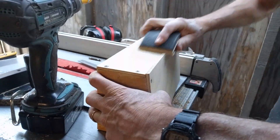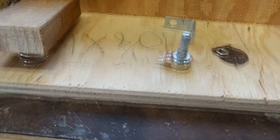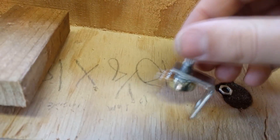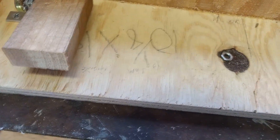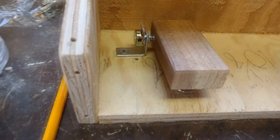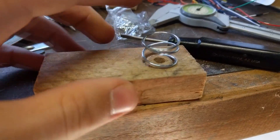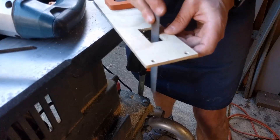After making the box, the next step is to mount the potentiometers inside — this is probably the most complicated part of the build. The way I went about mounting them was by first attaching them to an angle bracket like from a picture frame, and then screwing the bracket down into the wood. Next I attached the pedals to the potentiometers, added springs below the pedals, and then cut holes in the front of the box for the pedals to come out of.